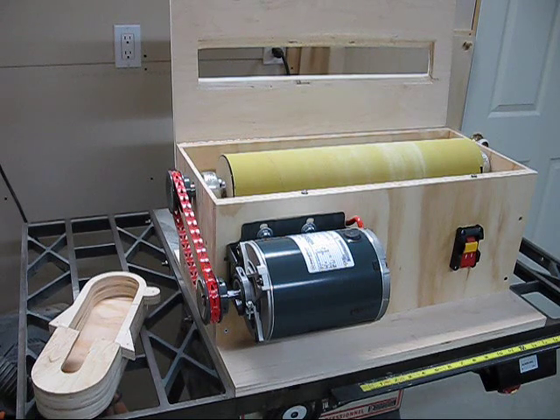The first thing I had to do was figure out the drum size — that is where it all starts. I decided I wanted an 18-inch long drum, four inches in diameter, so I needed it to be on a solid steel axle. I went down to my local steel yard and they provided me with a 7/8-inch diameter steel rod — a nice shiny finished steel bar. Since I wanted 18 inches long, I figured I needed enough for the bearings, plus to come through the box and put a pulley on the end of it, so I made up a figure of 24 inches.